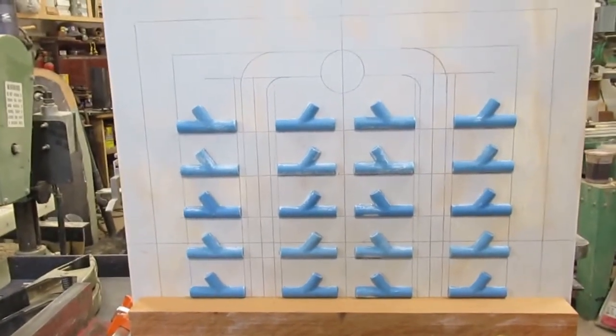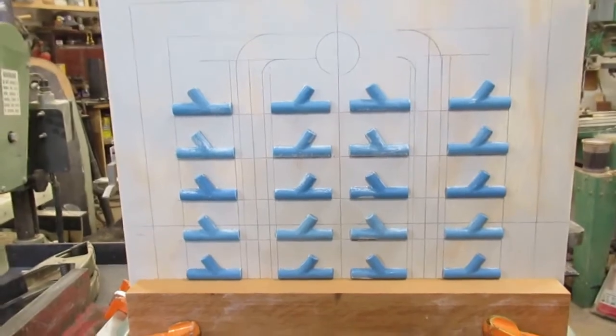One of the things I'm going to do, like I said last time, what we did was some sample castings. What I did, I used the runner for the risers. Okay, I'm not going to have any, I mean we'd have to have a whole bunch of little risers on this. We're not going to do it. So I'm just going to do the runner. We'll see how it comes out.